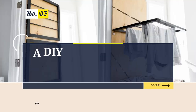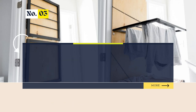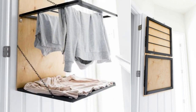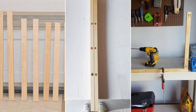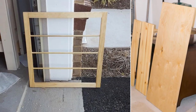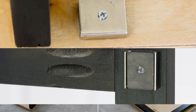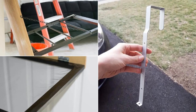Number 3: DIY Clothes Drying Rack Idea — How to Hang Your Clutter in Style. Maximize space with a versatile drying rack; position it near a power source and a sturdy wall anchor for both drying and ironing. Step 1: Construct frames by cutting, sanding, drilling, and attaching pieces for top and bottom racks. Step 2: Sand the plywood backer and paint or stain the racks. Step 3: Assemble the rack with hinges, secure with hanging strips or magnets, and add side support with chain and glue tulle on the bottom rack.